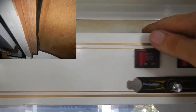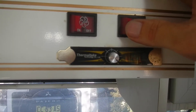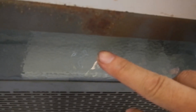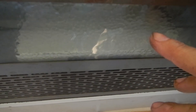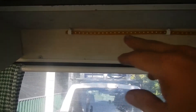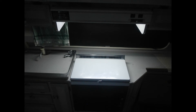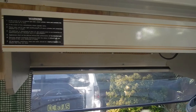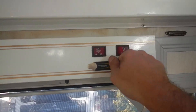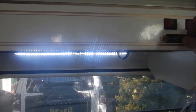Just a reminder — we jumped in up in the cupboard and ran the 12-volt along across the top of this cupboard into the back of the range hood. Switches still work, fan works, and there's our speed control — you can hear that kicking up. This is our LED light. Rather than putting the light back up inside, which was going to provide its own challenges and I wasn't going to be happy with the spread, I put a strip along under here. Frankly, this is probably where I've let myself down on this job — nobody's going to see it because it's up under there, but I think I'll come up with something better and tidier. So that's the LED strip there — she is a cool white. The reason I went with that one is to provide light down here and get more of a spread out to the side and over onto this bench.